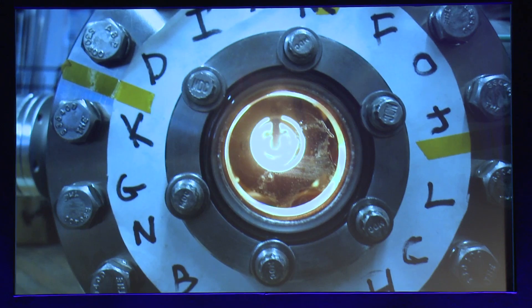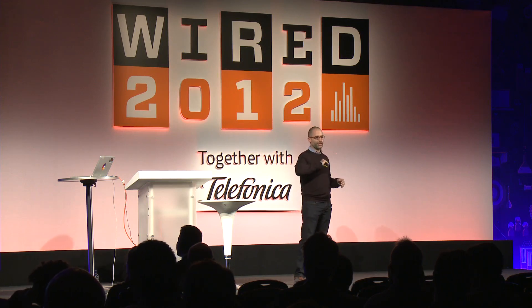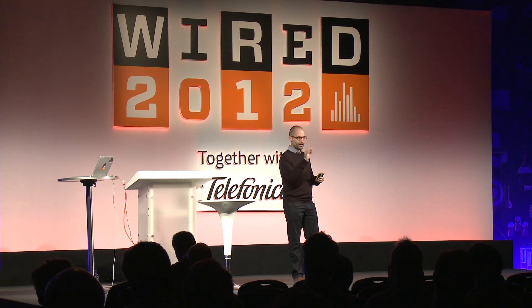This is the step beyond that experiment. Once we reproduced the Sydney results, I thought: what happens if you have only an electron population and not a mixed deuterium-electron population? So I created a handmade hot cathode electron gun — that's what's glowing in the window there. It's like what's inside an old-fashioned TV shooting electrons at the screen, but instead I'm shooting electrons into the core of the Polywell. When I turn the magnets on, it squeezes those electrons into the center. The crazy thing is when I actually ran this, I got the opposite of what I expected. I have no idea what that means — it probably just means my equipment's broken.